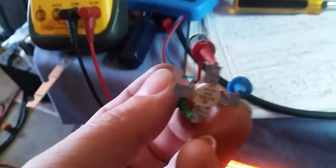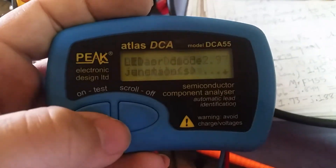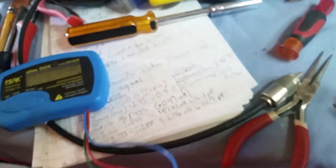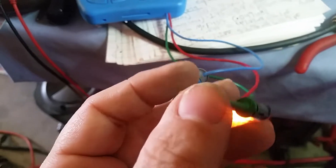These are stud mount. I hooked it back up to show you - it is not reading as a transistor. It's reading as LED or diode junctions. There's an issue from the collector to the emitter junction - some sort of damage there. That's letting me know the collector is not able to make a full circuit with ground, so that's causing the transistor to not work and that's why I'm getting about full reflect coming back to me.